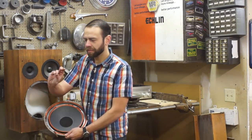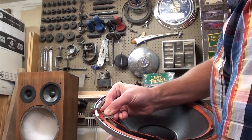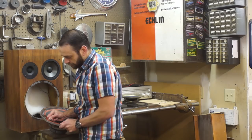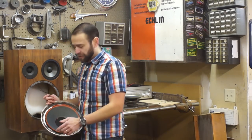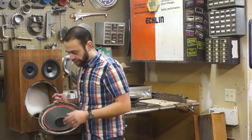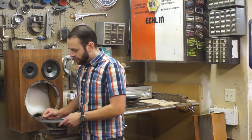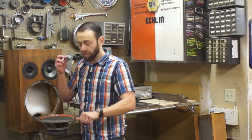You can see how that's coming off — nice and easy. Make sure your razor blade is nice and sharp; it just helps with this operation. You want this mating surface here to be nice and clean — you can see it still has a lot of old gunk. So we keep going around. Be careful not to cut the basket — that's what this outside part is called. This one's made of aluminum, a soft metal, so be careful that your steel tool doesn't cut into it. We go around and make sure all the old glue is out of the way because we want the new glue to stick really well.